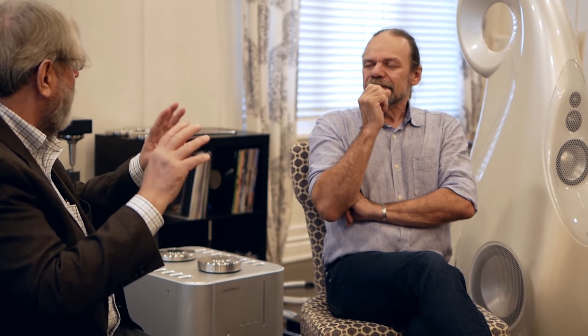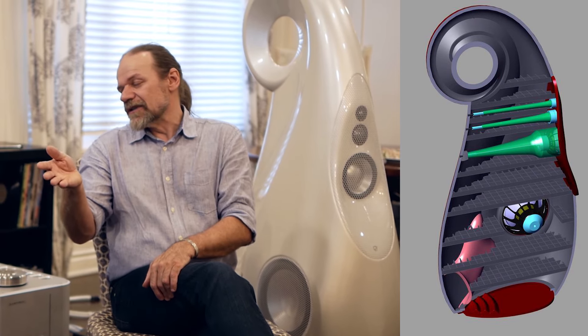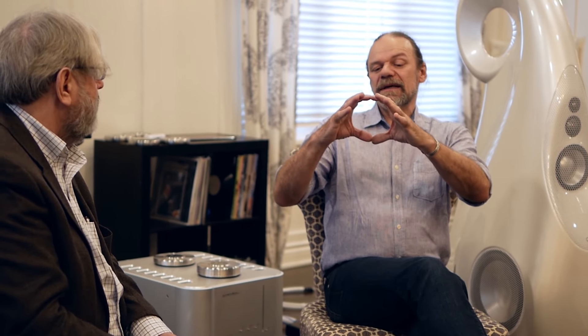The first thing I did was develop my own magnet FEA platforms — finite element analysis — to analyze and optimize the magnetic structure by looking at the magnetic circuit in small segments so you can model what's going on in each little bit. My criteria were to have a big hole in the middle for free passage of sound from the rear of the diaphragm, but I was also adamant about getting the drivers as close together as possible because of vertical dispersion. Using conventional annular magnets, to achieve about two teslas, they'd end up maybe 100-something millimeters in diameter, making the gap between drivers too large.